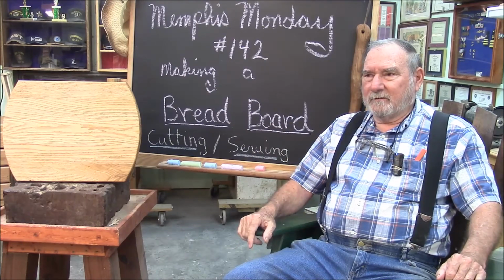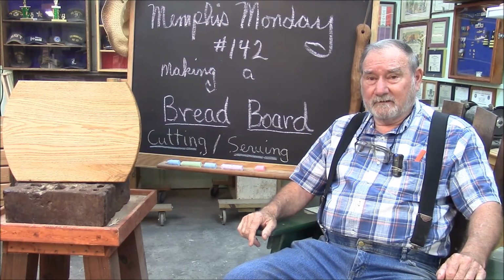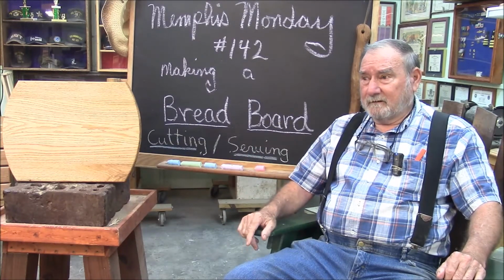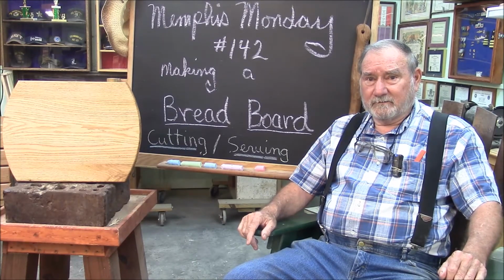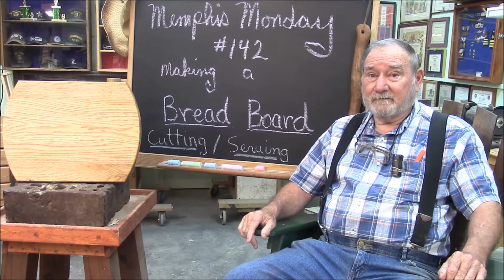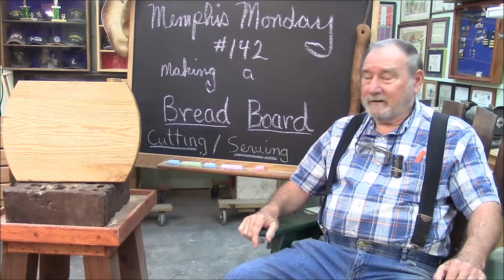You might ask yourself, why'd I go to all the trouble of making it out of firewood? Well, you can't get 1.5 inch thick stock. You probably noticed if you watch a lot of woodworking videos, a lot of the heavy hitters out there get all their stock from a sawmill, or they mill it themselves, because standard dimensional lumber you get at like Lowe's or Home Depot is not 1.5 inches thick, and for a breadboard, it needs to be at least 5/4. Sometimes they're 2 inches thick.